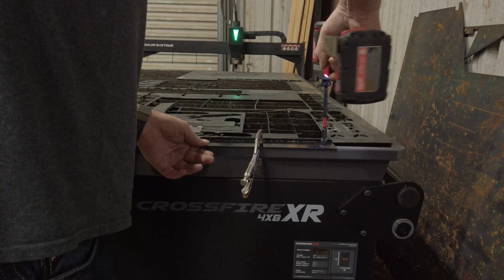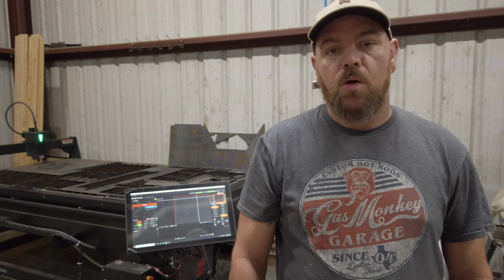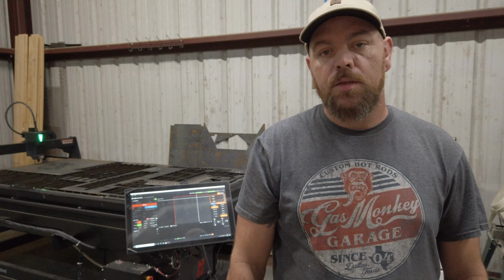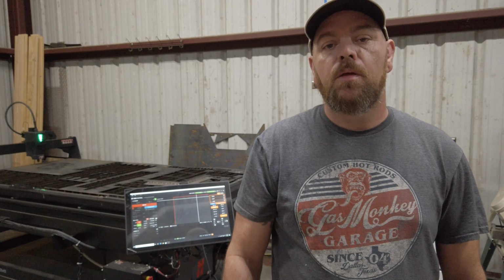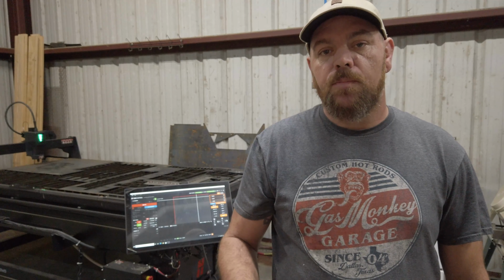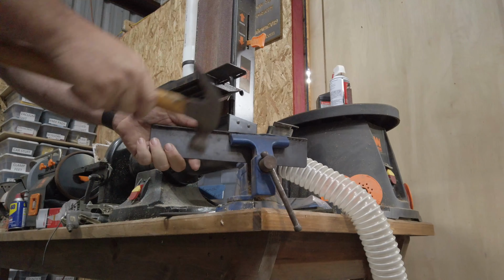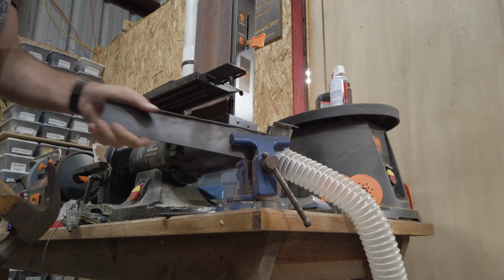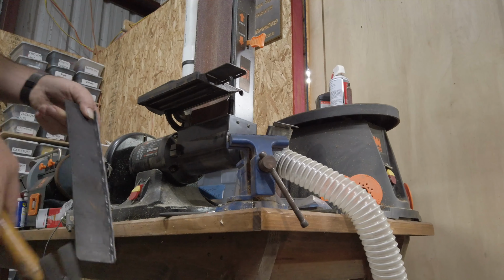There's going to be 2 versions of the file on FireShare, one with 4 parts and one with 3 parts. I use the 4-part design in my shop. Because I don't have a sheet metal brake in my shop yet, I found it really difficult to bend the fingers up at 90 degrees on the 90-degree piece and still have them be 90 degrees of each other also. If you use the 4-piece design, you can easily put them in a vise and hammer over the fingers.